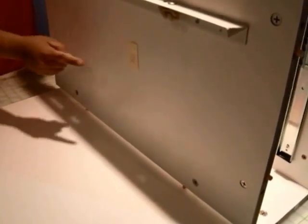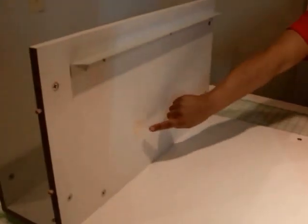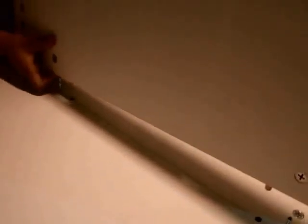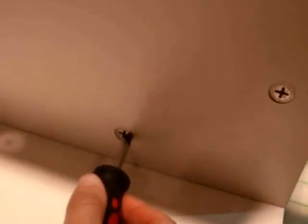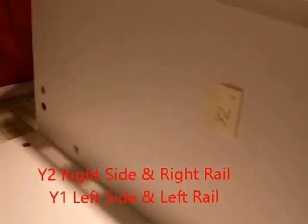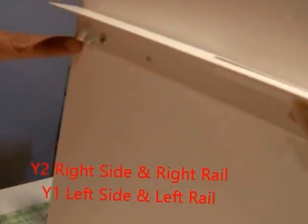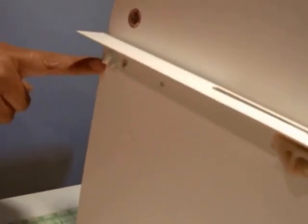Step 5: take your Y2 panel and your Y1 panel and attach them to panel D. Take your cam bolts, line them up with the cams and the wood dowels in the holes, put them down, and then lock them with the screwdriver. Note the orientation of the slot on the rail — the slot is towards the top of the cabinet.